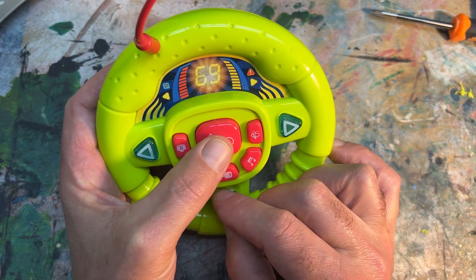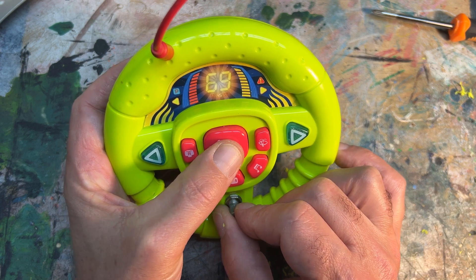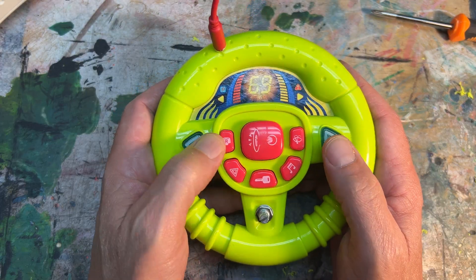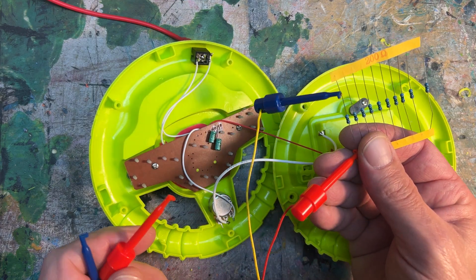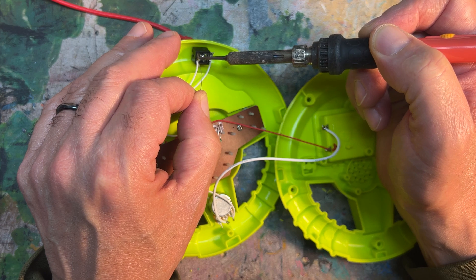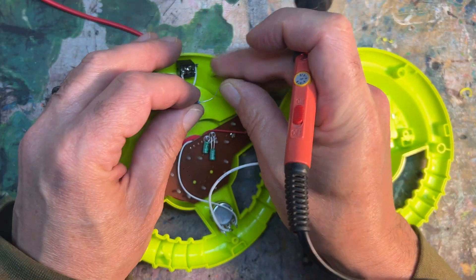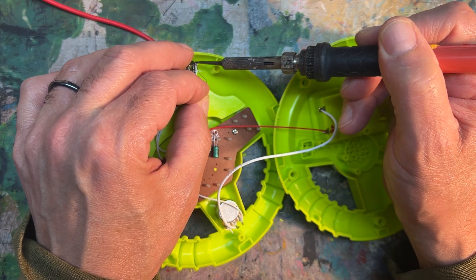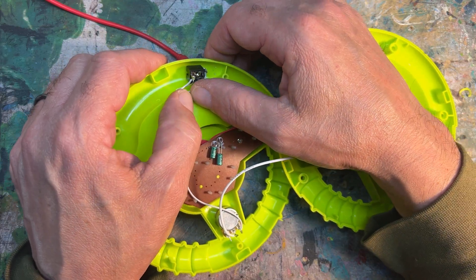As I'm testing the toy, I make mental notes as to how it responds, what sounds I'm able to get out of it, so that as I experiment with other resistors, I'll have something to compare it to. After much experimentation, I decided I'm going to install a 200 ohm fixed resistor on both sides of the output. There are infinite numbers of choices you can make when circuit bending — it just may or may not be the result that you're looking for. I used a resistor; you could try using different capacitors. I'm showing you my method, but there's really no rules. This is circuit bending.